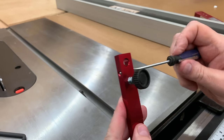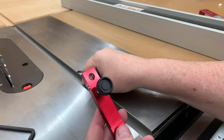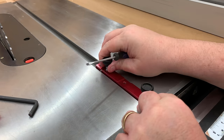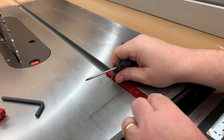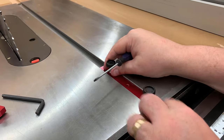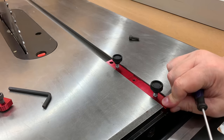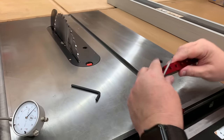They're spring-loaded little ball bearings, so you can screw them out just a tiny bit bigger than the slot opening. Once you get them just right — they can't be too big — they'll pop in and since they're spring-loaded they'll hold a nice tight fit. That tight fit is essential to get an accurate reading on where the table saw blade is in relation to the miter slot.